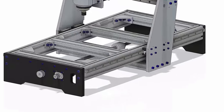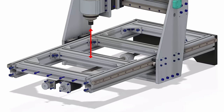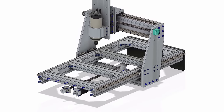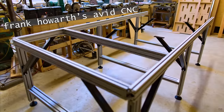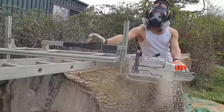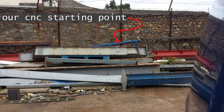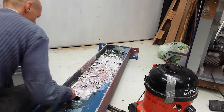There are a million variants on this basic design: T-slot aluminium profile making the frame, with z-height gained by expensive pre-milled aluminium plates. I felt this style of machine was unduly popular — it seemed to come with stiffness, damping, and cost problems, cloaked in a sheen of convenience. That stuff is extremely handy for makers; we've used it ourselves on the chainsaw mill, for example. It just doesn't seem to fulfill the requirements of a massively sturdy, vibration-damped frame. In fact, the one thing aluminium really has going for it is its strength-to-weight ratio, and because the frame's not moving anywhere, we're not too bothered about weight.